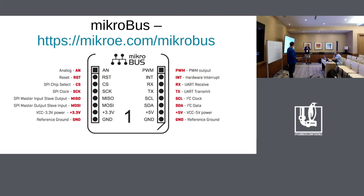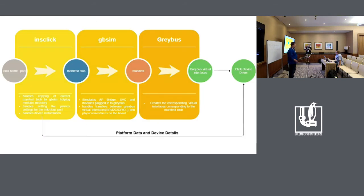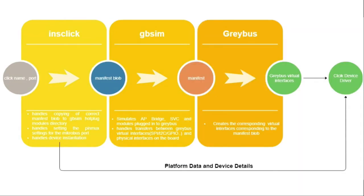So part of this is you can easily plug in different modules, and when you're plugging in different modules, right now what you'd have to do is go in and set the overlays in the bootloader, and our Google Summer of Code student thought that somewhat broke the rapid prototyping flow for him. So he thought of a way of using Greybus and GBSim to have this workflow for when you insert click modules in. So he wrote a Python script called insclick, which had a set of JavaScript Object Notation entries for the different sets of clicks